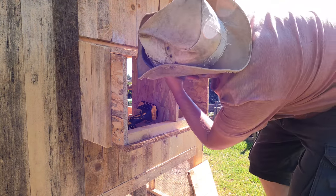So in addition to making some changes to the way the door was built and hung and overlapped, I also added a couple of extra features, including some roofing membrane to make sure there was no chance of any water finding its way in. And I also added a little bit of flashing above. But I think our small technical issue has resolved itself, so let's get back to the build with a live action soundtrack.